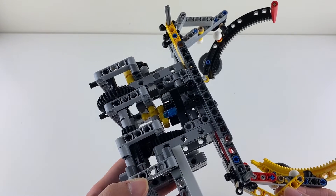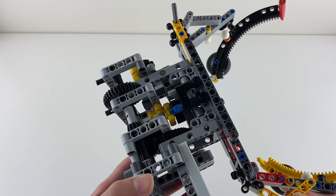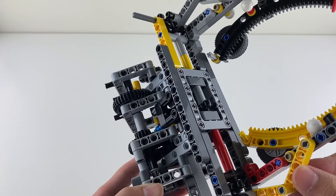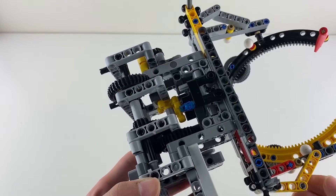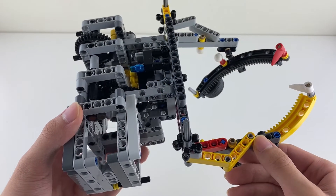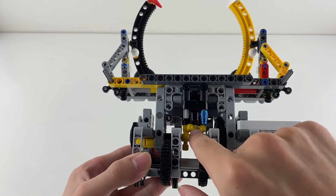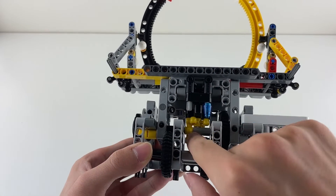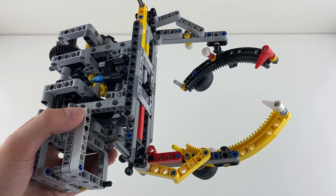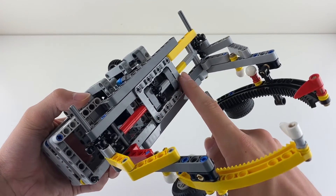Here's what the first mechanism looks like when taken off of the attachment. It's basically a grab and lift mechanism. Using one motor, you can both grab something and lift it up at the same time. The grab and lift mechanism works by transferring energy to different places at different times. Let's take a look at these two yellow gears — the grabbing gear up here and the lifting gear over here. The grabbing gear controls the opening and closing of the claws, connected to each claw with this system of gears.